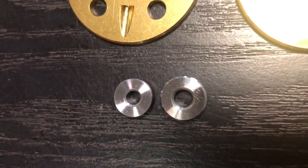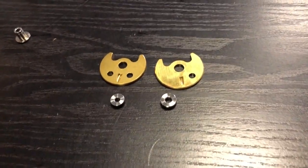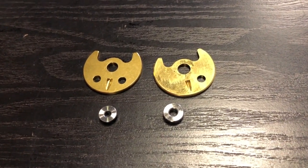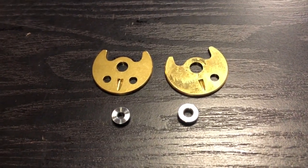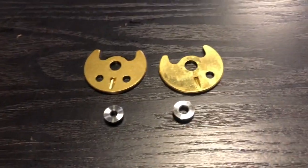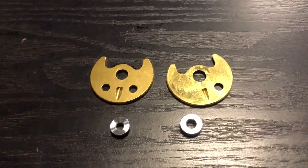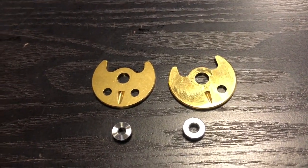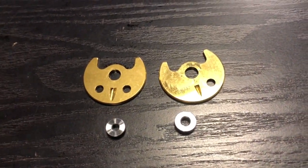The question is: are the thrust components in a TD-04 bearing system able to handle the thrust loading of the enlarged TD-04 — with guys often going for 18T and 16T size compressors and matching turbines? Well, the answer is not really, because the boost pressures that most people upgrading N54 turbochargers are aiming for require two to two-and-a-half bar boost pressure, and the thrust assembly for that size rotating assembly will never, ever be reliable.